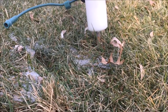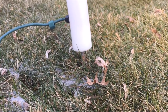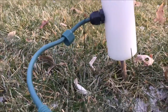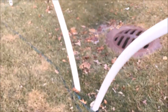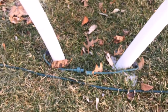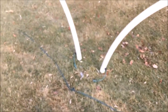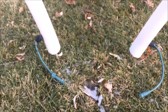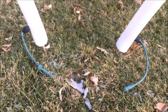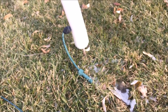The bottoms of the arches are simply stakes that come straight through — this is threaded rod that goes into a plug at the end. One of these was loose enough I could pull it out. You'll see I've got a PG-9 connector in there with the DIY LED Express pigtail hanging out. That's the in, and over on the other side the same thing as the out. So I have these set up in pairs — two arches daisy-chained — and I'm feeding power from both ends. Where I come to the next arch, you'll see the SPT cord where the power plugs in and the two power connectors. The power is back-feeding in the end, and the data picks up to feed the next one along with power.